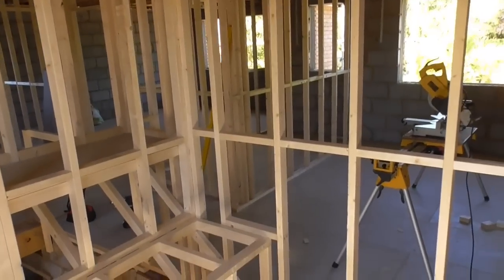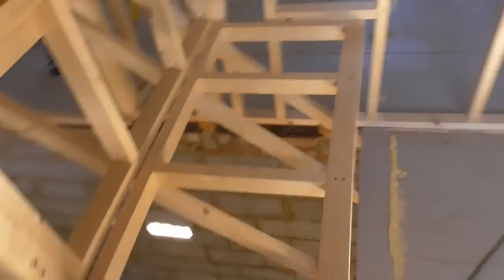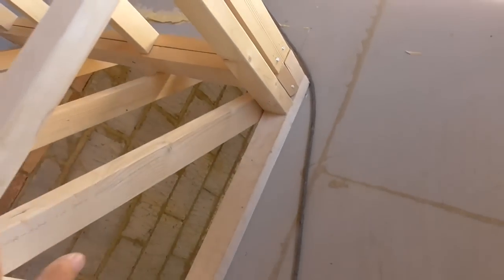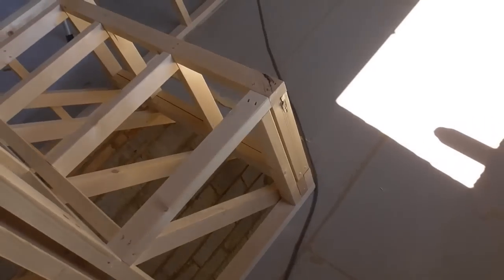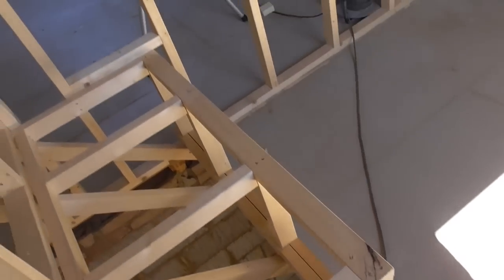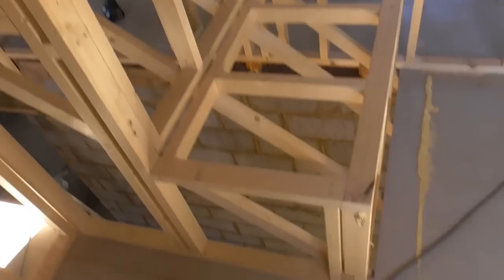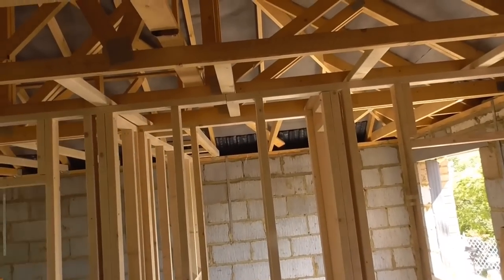This house is likely going to the open market, and the idea I had is that we could suggest to any potential buyer that we build a bed deck in here. If it was my house I'd have done it already. It's only about 450mm off the floor — some divans are that high. The idea would be to carry that deck through with storage drawers underneath, giving a nice decent-size single bed: 1.1 metres wide and 2.2 metres long. Although it's still a small room, you'd then have a full-size bed plus space for a wardrobe and dressing table. Bulkheads are a fantastic idea because they maximise the space in the room instead of wasting it in a giant stairwell with a lightbulb right up high that you can never change.